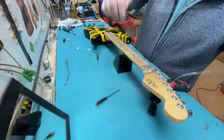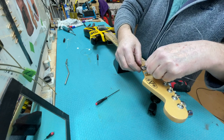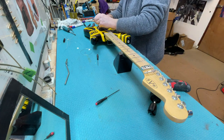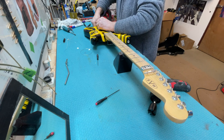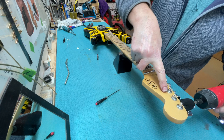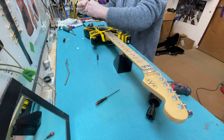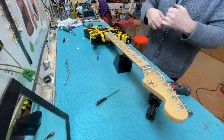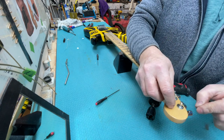It also applies, that same thing applies when you're doing electronics and you put a bunch of wiring together and then it doesn't work the first time, or somebody brings you something that isn't working and says, can you diagnose what's wrong with somebody else's wiring and put it right? And that's a really difficult thing to do. The only chance you've got of figuring out what's wrong is to do the same thing, to cut down the number of possible variables in it. So I basically iron out all the things that could change and endeavor to change only one thing at a time, and that way you can track what change it makes or what goes wrong or right.